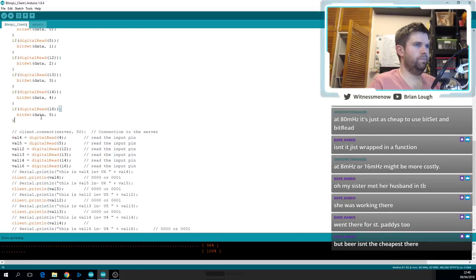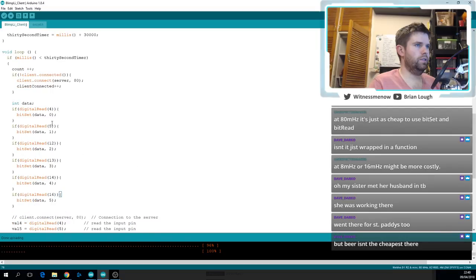Yeah, so that should be enough bits. So then I can just do a client print. I think I'll just do a print as well. I'm not sure if you're still there, Sophi, but I think the reason you needed to increase the characters each time is because you were doing a println, which was adding the return characters. So 0 would have been the one you wanted, and then 1 and 2 were the return characters.